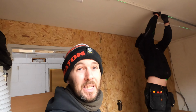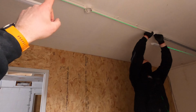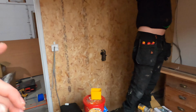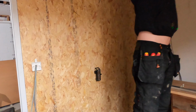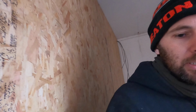So the plan is, in here we've got 2 5-foot LED single battens. We've got the light switch going from there, so we're going to run that up in some conduit, in some singles is what we're going to use. Now over this side of the garage, there's going to be 2 double sockets either side running. Also, if you watch the video from yesterday, the cables that we've brought through are all up here, so they're going to control all the outside light stuff, the decorative ones that are all on the pillars. So that is the plan for us right now.